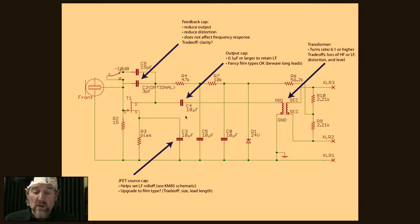This particular microphone has pretty much unfiltered low frequency response. Let me say that a different way. Many microphones will filter the low frequency output. This one kind of doesn't, which could be good or bad. If you want to build a mic for low frequency sounds, this is great. If you're having a lot of problems with rumble, then this might not work to your advantage.